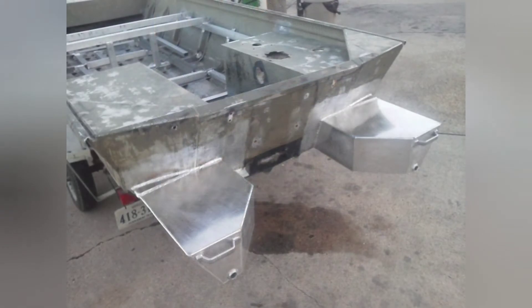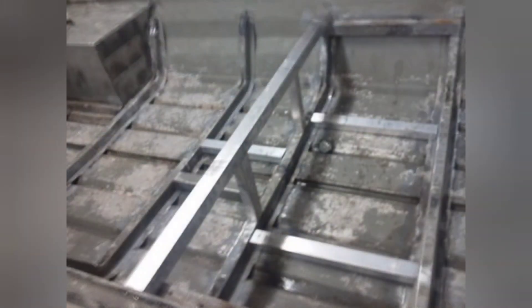I went through and marked all of the welds that needed to be fixed so they were easily found by my welder. The next step was to weld on the beaver tail pods that we ordered for the boat. These pods were a great addition — they add a lot of flotation to the rear of the boat, compensating for the weight of the motor, help it plane off quicker, and make a great step for your dog and people getting in and out while duck hunting.